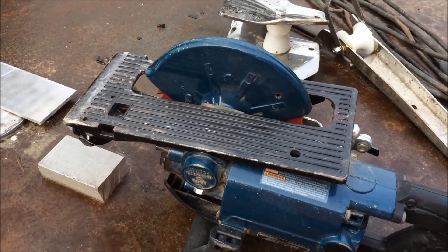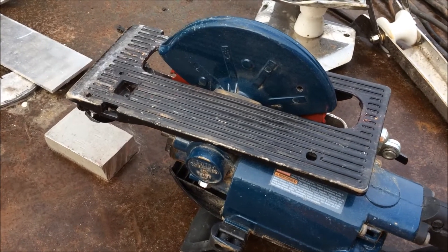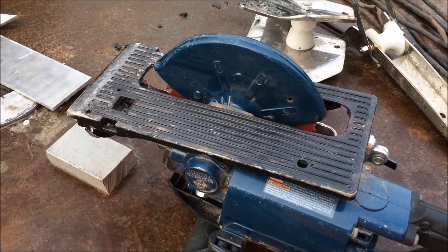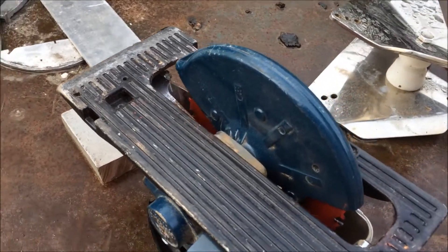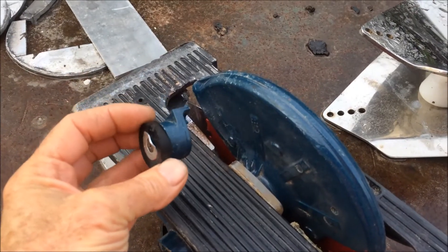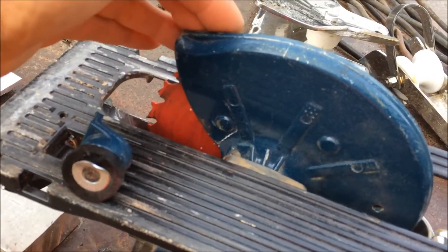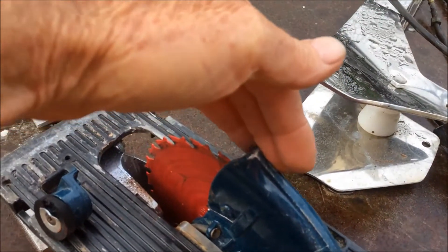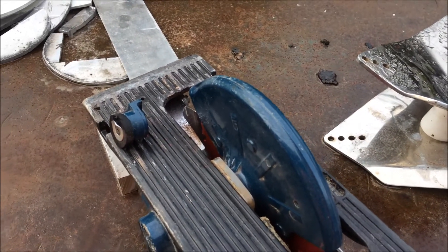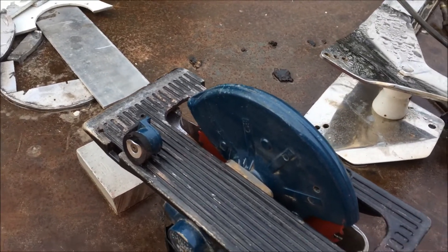I'm going to do a little safety video. I've been cutting aluminum with my skill saw and my table saw for a long time. But last week I was cutting out the little hatch openings, and in order to make it go faster I was using a skill saw to cut out lots of little pie shapes. One of the pie shapes dropped and got stuck in the saw blade. There was a small explosion — one piece tried to go through my wrist, another piece broke off the saw, another jammed into the guard, cracked it and bent it to the blade, and there was a tooth bent on the blade. All that happened in about one tenth of a second and it scared the crap out of me. So be careful about drops — if you drop a little piece of wood and it gets in the blade it's usually not that big a deal, but when a piece of aluminum gets stuck in there, it ain't nice.